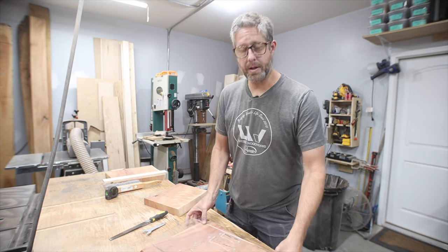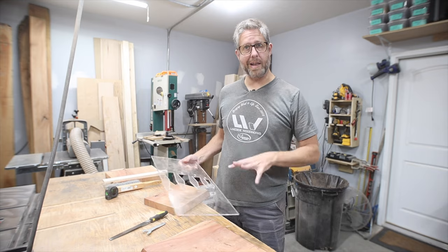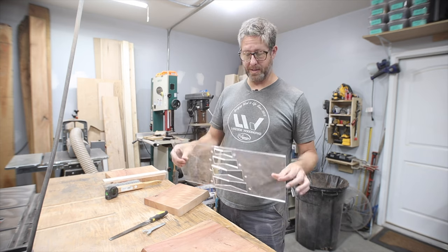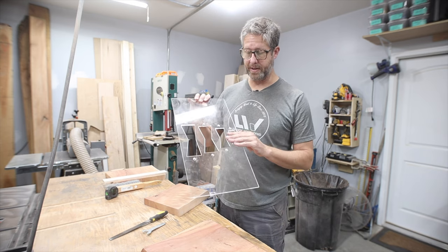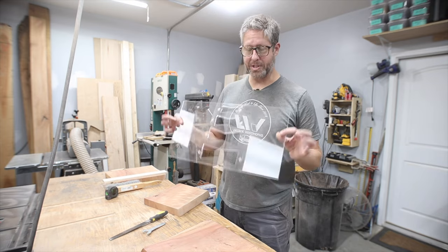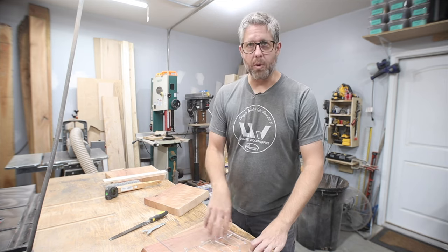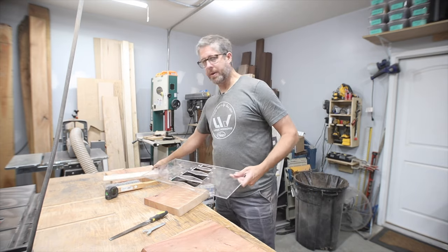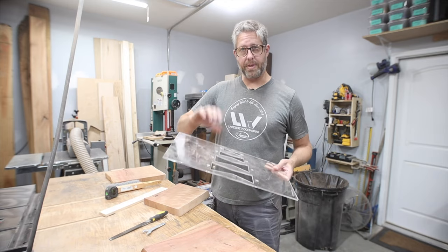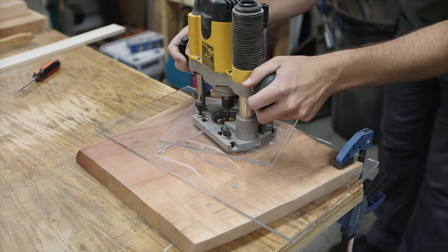The next part is going to be to correct some of the blemishes and cracks in these slabs. I've got a bow tie template that's on my Etsy store and website — it looks slightly different because UPS liked cracking the original ones right down the middle, so I redesigned it. It's a better design and you still get four sizes in one. You put it down, clamp it, mortise out your piece, then use the same template to cut out your bow ties. I'm going to use really blonde maple because I like the contrast. I'll link below to this as well as the white side router kit.